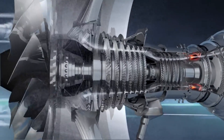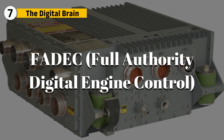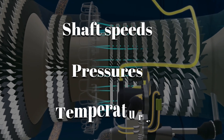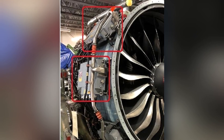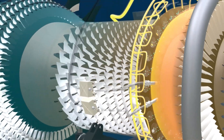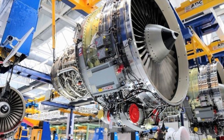Now something has to keep it all in sync — that's FADEC. Pilot sets thrust; FADEC, full authority digital engine control, runs the show. Two independent computers watch shaft speeds, pressures, temperatures, vibration, and fuel flow, cross-checking constantly. If one channel hiccups, the other keeps going. FADEC angles vanes, opens bleed valves, meters fuel with surgical finesse, and guards every limit so the engine never cooks itself or stalls. Quiet conductor, very loud orchestra.